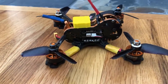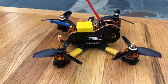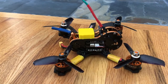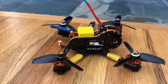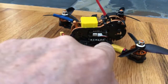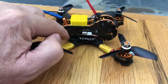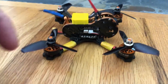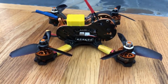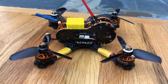This is a follow-up to my last video. There was a problem with the machine — this receiver I have in here sometimes gets overwhelmed with the electronic noise kicked out by the ESCs down here. The only place I could put the receiver inside the frame was right down in here, and I noticed that under high throttle I would lose control of the quadcopter and it would do a runaway for a couple of seconds.